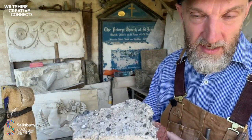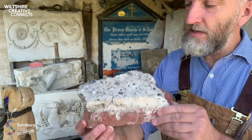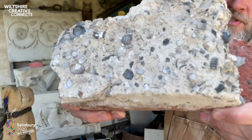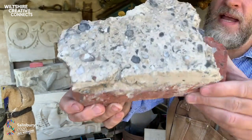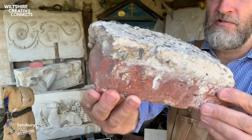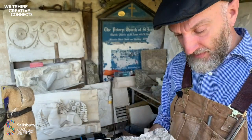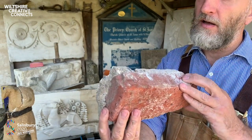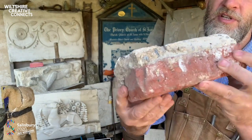But last but not least, another prize exhibit in the Zimsonian is this. So this is not a stone. This is lime mortar. It's actually a lime render made exclusively from seashells. So seashells have been added as aggregate or ballast to the lime, and the lime is probably made from fired seashells, and this is a fairly common way of gluing together building materials